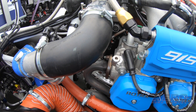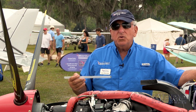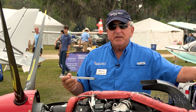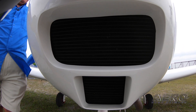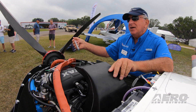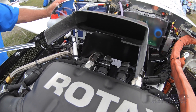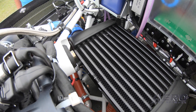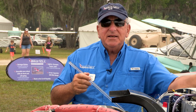In order to dissipate heat on a million or two million dollar Cessna 421, you would find an oil cooler, which you'd never find on a little plane. This plane has an oversized oil cooler to help with the heat, and you also have an intercooler with this box that forces air in through the intercooler before the air gets fed back into the turbo. There's also a cowl flap on the bottom of the cowling — a permanent cowl flap that sucks hot air out — and on the top cowling there are three air scoops that force air in and out of the engine and into the intercooler.